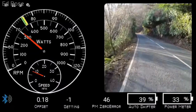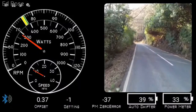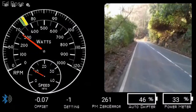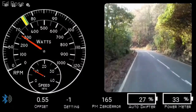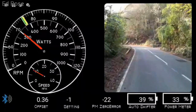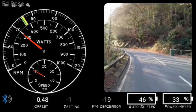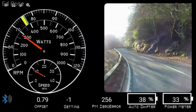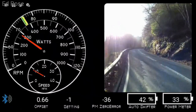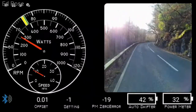Basically what this means is that we can take gear shifting and cadence out of the equation. As long as I keep within around 8-30mph it will maintain constant cadence, because I've got it in constant cadence mode and the setting is around 75rpm. What I'm planning to do is climb this hill over the top and down the other side whilst maintaining around 250-350 watts.